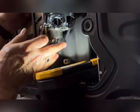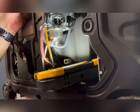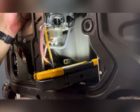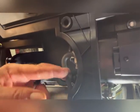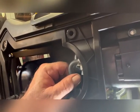Okay, this is the vent line here. So I need to either cap it up there, which I really don't want to do because then I can't go back to just running a regular gas tank because it'll have no venting. So I think what I'll end up doing is putting a valve right here. And that will block that off when I'm using it on the extended. And then I can open this valve up when it's off the extended.